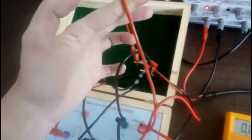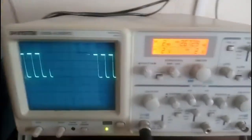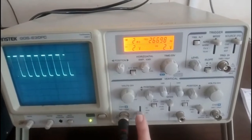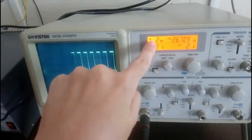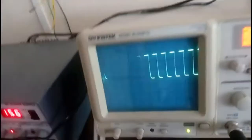To observe the waveforms, connect two CRO probes here. I have taken two patch cords and connected crocodile clips so connections will not be loose. For CRO settings, I have selected channel one source to channel one, and the input is set to DC. Also check the time setting — whether it is 1 millisecond, 2 millisecond — because this value is very important in our calculations.